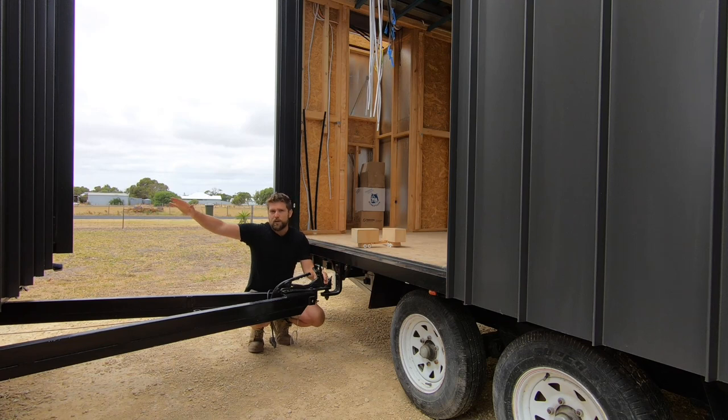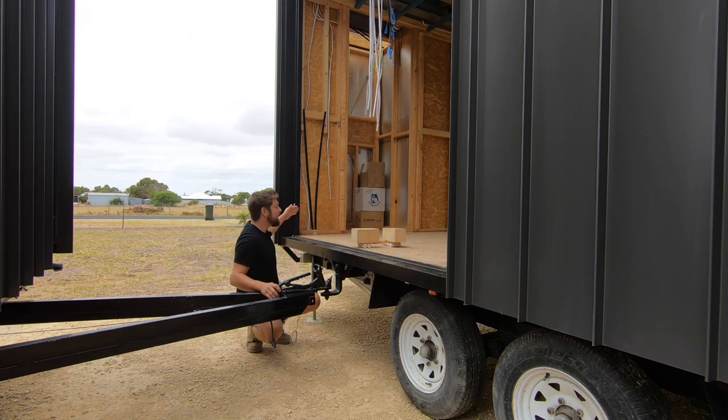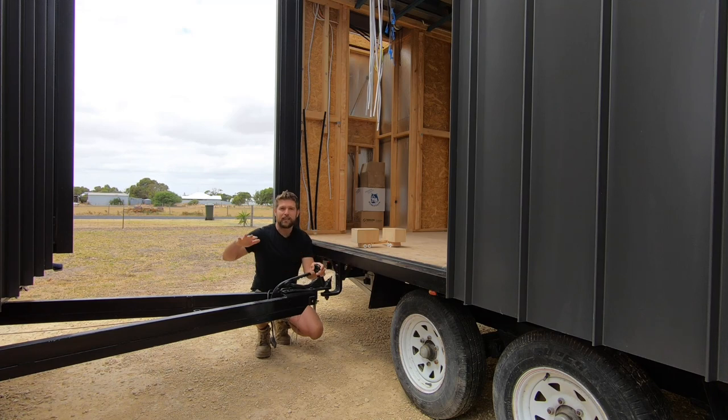The next thing our datum point gives us is a height reference. Because the main trailer is hooked onto the side of the side trailer, it sets the height at which that trailer is going to meet the side trailer. Because the tow hitch is close to being in line with where my locking pins go into the side trailer, it sets the height of those locking pins. They're not perfectly aligned, but as long as I get these trailers close to level, those pins line up perfectly. That's critical because the swinging walls have tracks on them that the sliding roof will slide over, so I need those tracks to line up perfectly so the rollers roll smoothly.